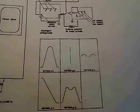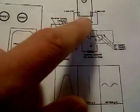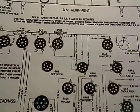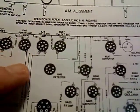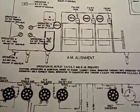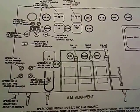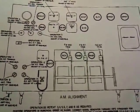We might fiddle around a little bit to make sure we have a nice IF signal going through it. These are some waveforms you would see on your scope during the FM alignment — that's the setup of the equipment there. And this is just a reminder of tubes and which pins are what. It's very handy. I'm a little disappointed with the very first stage of this alignment, so that's why we might have to fiddle around before we really get going.